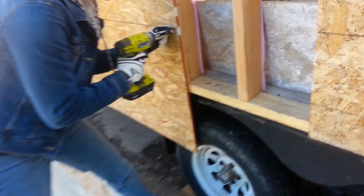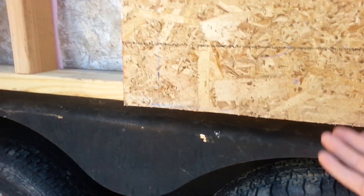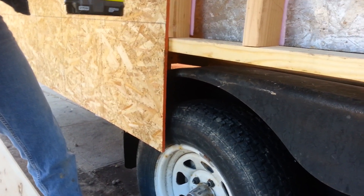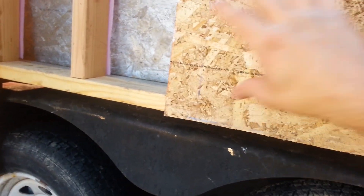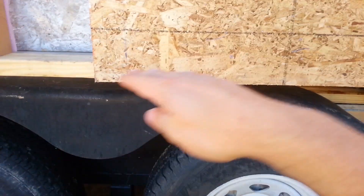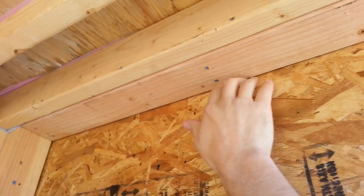This is the OSB that goes on the side. When it's all screwed in it really gives the whole structure some solidity. These slats will have something to screw to no matter if there's a stud there or not. We're gonna cut this off with a saw wherever it needs to be, just put this piece on and run a saw along here. The whole thing is gonna get covered anyway.